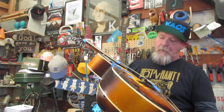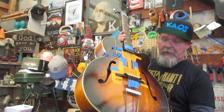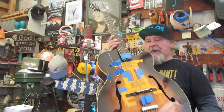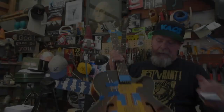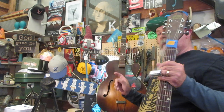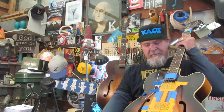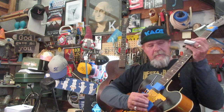What we're going to do is I've marked this thing up to cut the pickups in it. I'm going to show you a couple of pitfalls along the way when you start cutting into these things, because archtops aren't just pretty — they're functional. There are things inside here that you might think are braces but are actually tone bars. In the interest of time, I have marked this one up so we know where we're going to cut.